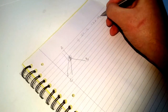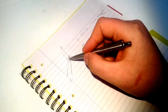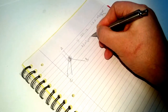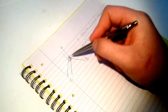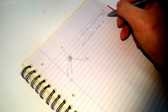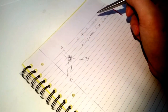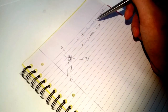The second parameter is how long you keep it on — the alignment time. This has a lot to do with the inertia of the rotor and load. For a motor with large inertia, this can be as long as a second; for a much lower inertia motor it might be as short as 30 to 40 milliseconds. So first we align the rotor: we PWM the voltage down to an acceptable level and hold it for the alignment time.